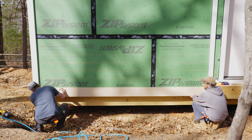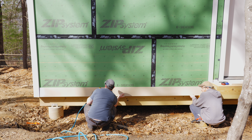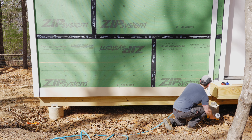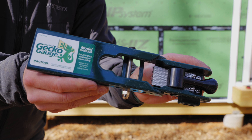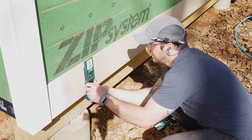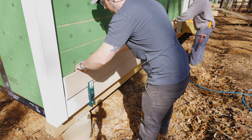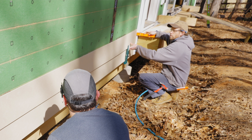We installed the first row with the bottom edge even with the trim board. The Simple Sider jig came in handy to ensure a nice even 3/16-inch gap on both ends. Because we had 24-inch on-center spacing on the framing, we had to add nails every 8 inches — on every stud and two nails between every stud. After getting that first row installed, we could start using those Gecko gauges. They have a thin plate that slides up under your previous row of lap siding, and a little arm on the front to lock the gauges in place. One thing to note: the instructions say not to crank all the way down on the arms, or the gauges can space off the face of the previous row and boards can slip behind the gauges.